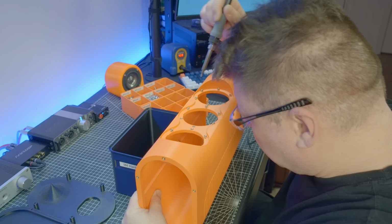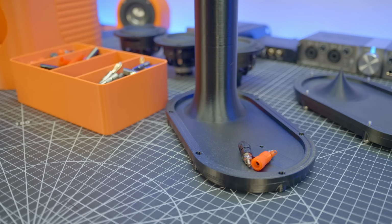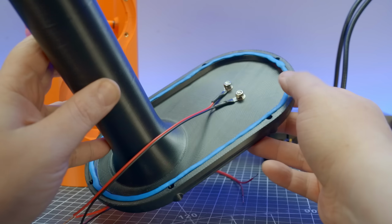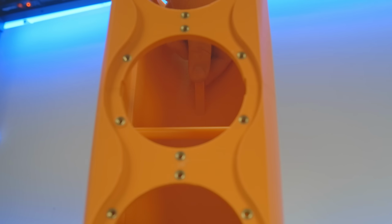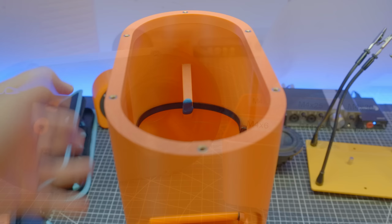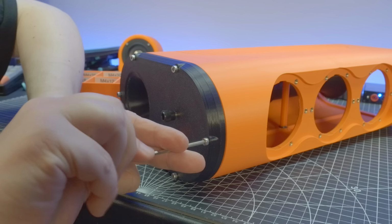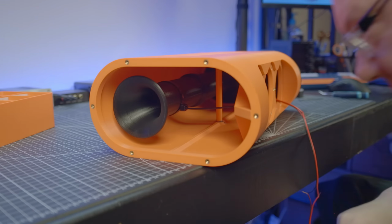Some binding posts for the vented end cap while everything is still easily accessible, a shallow depth of field shot of some armature with a soldering iron, and a gasket of reusable adhesive along that entire inner recess. Also, a tiny patch over here for the vent to press up against. A heavy-duty zip tie to hold it in place, and some M4x20 screws for the end cap. That comes together like so. The gasket is squished flat, forming an air seal, and the zip tie is zip-tied.